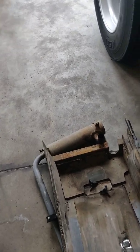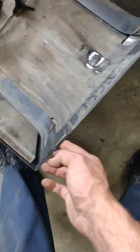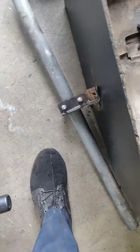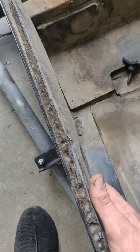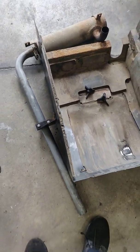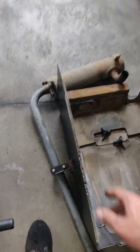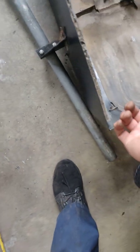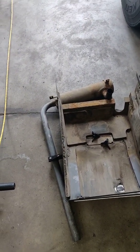You should be able to take them off. It's pretty easy. You take off bolts on the right here, right here, right here, right here. Then there's a bolt and a nut for the muffler. It holds right here. Let me get an all around view. Once you take them off, so it's 1, 2, 3, 4, 5. That's for the bottom cover. You take them off, you slide the cover out, take off the top cover.